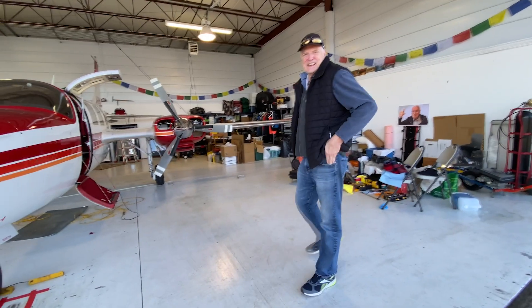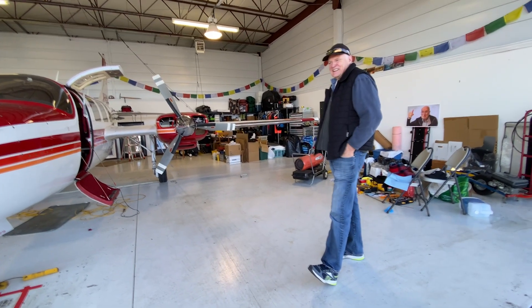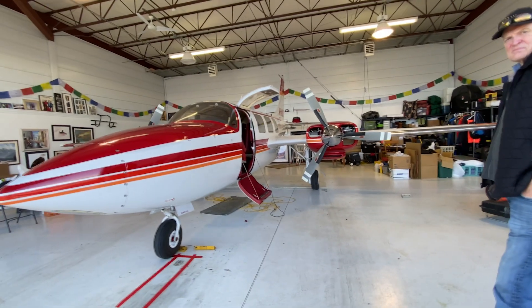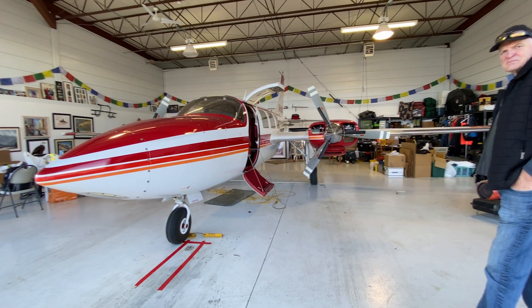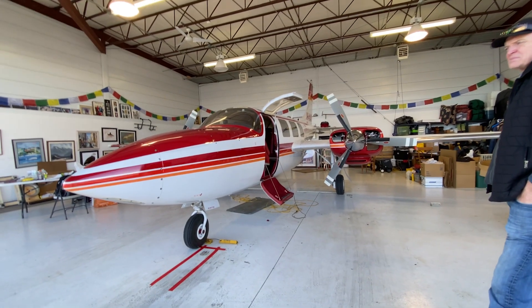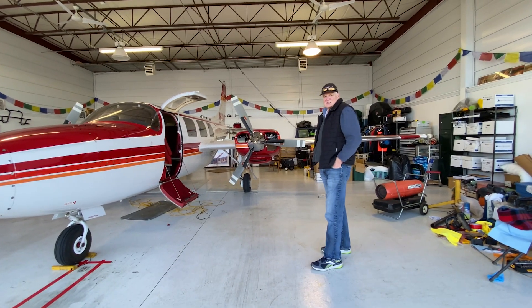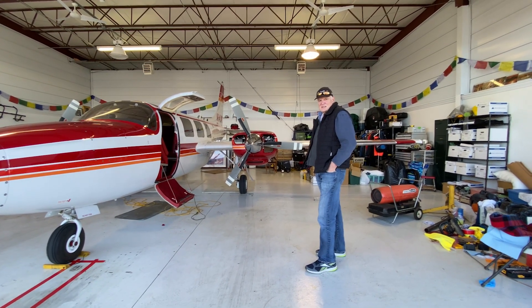What we're going to do is seat the brakes, which is a procedure that RAPCO defines for the organic brakes. After that, we'll get clearance to do a high-speed taxi down runway 16, which is about 10,000 feet. We'll probably run it up to about 100 knots, which is faster than we really need to go.